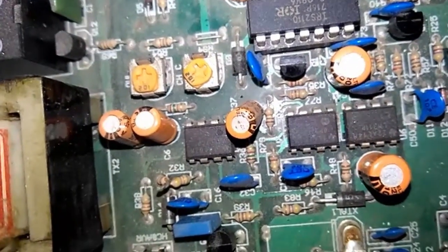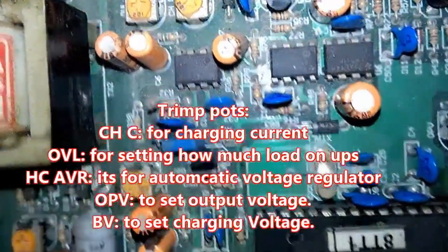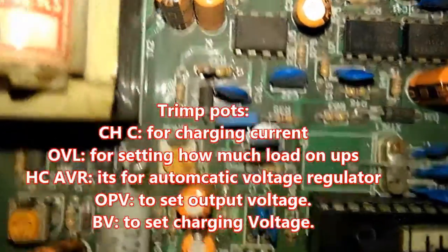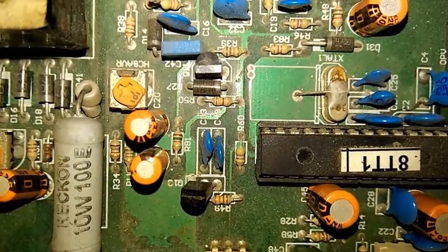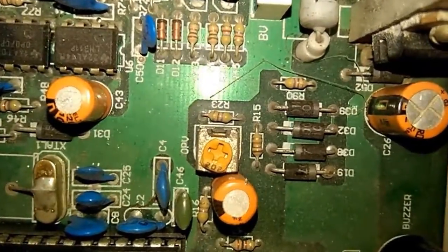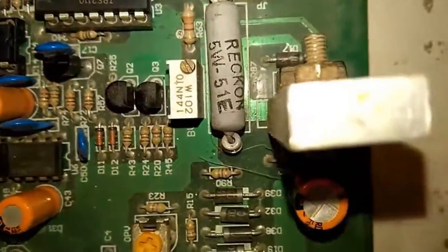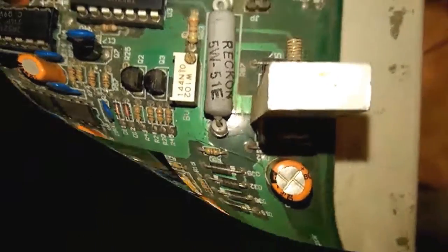This CHC port is for setting the charging current. OVL is to set the overload threshold. This port is for the high/low-cut automatic voltage regulator (AVR) setting. This one is to set the output voltage. And one more port here — this is to set the battery voltage. If you want to increase the battery voltage, you can increase it here.